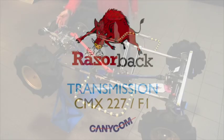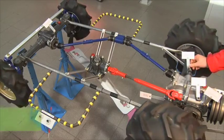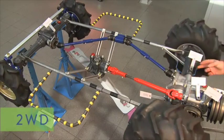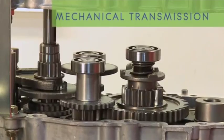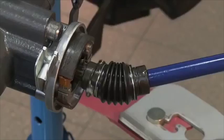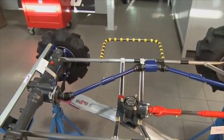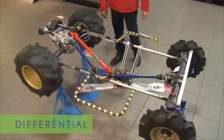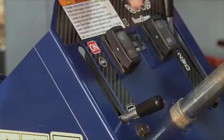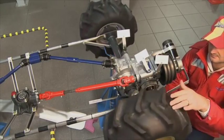The Razorback has a mechanically based dual range four-wheel drive system that is coupled to an infinitely variable hydrostatic transmission. The mower can also be driven in two-wheel drive. The mechanical drive train resembles a Land Cruiser or Patrol, with drive shafts from the gearbox to the centre of the mower, with universal joints through to the front axle. Flicking a lever on the dashboard engages a case-hardened steel mechanical diff lock, which works equally well climbing or descending steep slopes in demanding situations.